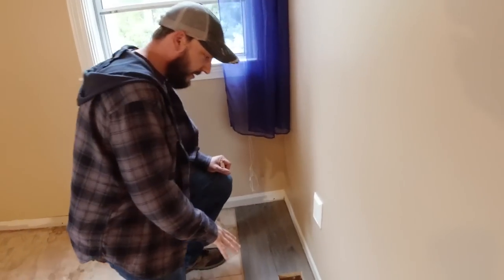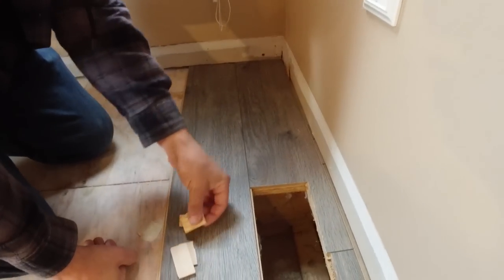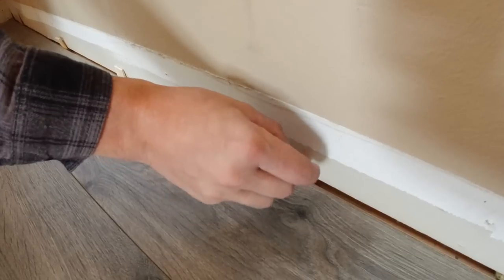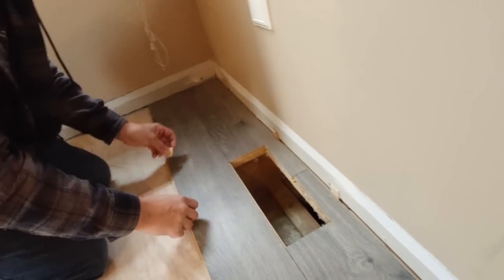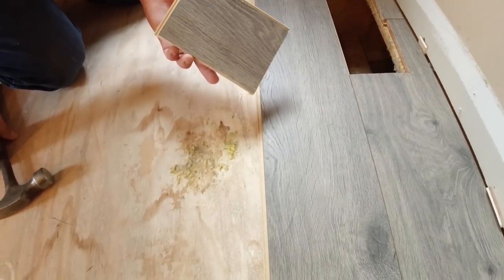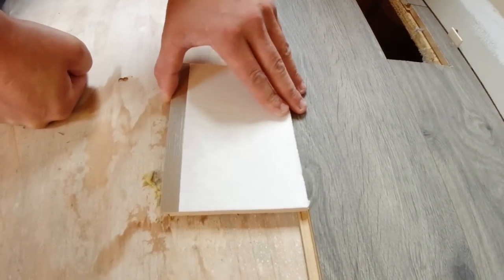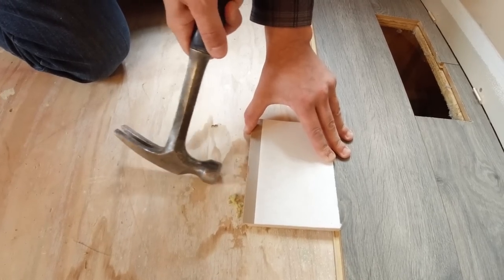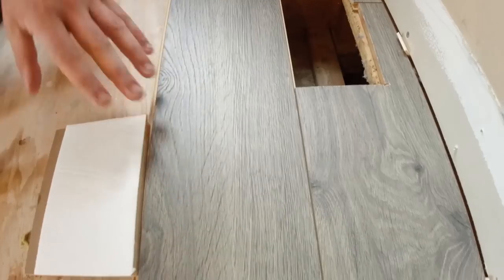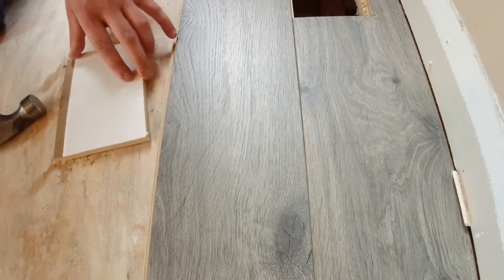So we've got our first couple pieces started here. What I like to do is cut these little pieces of wood and use them as spacers against the wall, because you want to have a space for it to expand and contract. So once you put these here, you're able to push it up against the wall. The way these things go together, you want to make sure that they're going to be tight. So you take a scrap piece of wood — we're not going to hit against this edge, we want to hit against this more solid edge — and just tap it. If you look here and you've got a gap, you take your piece of wood and you watch the gap right there as you hammer it. It goes right into place and sits down.